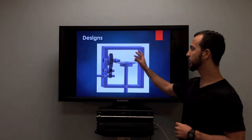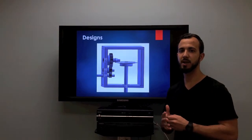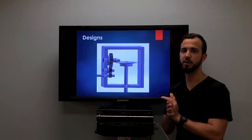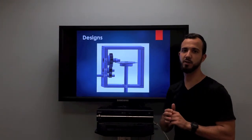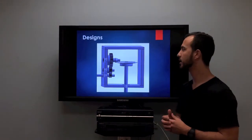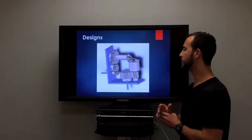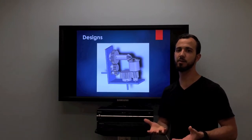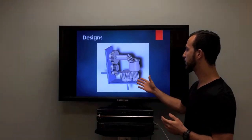But when we finished doing this, we realized that we had looked at the Boston Gear catalog incorrectly, and our horsepower and torque ratings with our satisfied RPM for each gear through the reduction were not sufficient, and the AGMA of course didn't pass. So in our next prototype design, we beefed up the gears a little bit, made sure that we understood the catalog more clearly, and this is what we came up with.